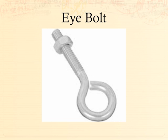An eye bolt uses the same threads, nuts, and washers as carriage bolts and hex bolts. The eye is formed by taking a piece of rod, putting threads on it, and then bending a loop in one end to make the eye. You'd use this to attach a bolt to a board and then use the eye to attach a rope, hook, cable, or chain. The common version at hardware stores is just a piece of rod bent into a loop — not rated per se. If you overload it, the eye will straighten out because it's not connected; it's bent into a loop.